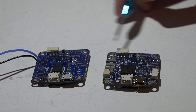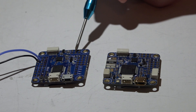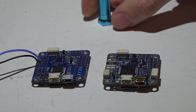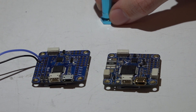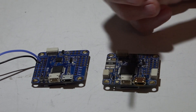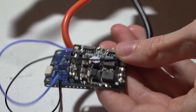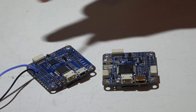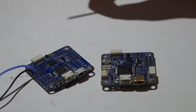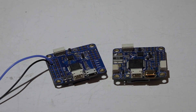Another reason I say don't use these pins: the instructions and manuals say these pins are filtered, and I'm not going to say that's a lie, but a 5-volt regulator is not an LC filter — it's just not the same thing. So don't think you're going to get extra filtering by using these pins compared to using a PDB with a 5-volt or 12-volt regulator. It's going to be exactly the same. And if you're using full battery voltage, there's not even a regulator, so there's zero filtering.